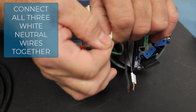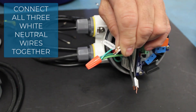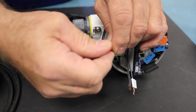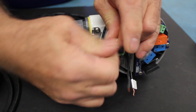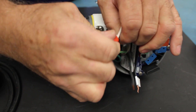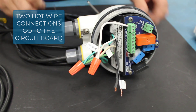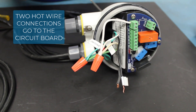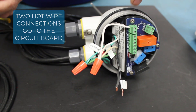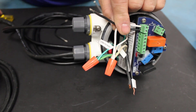We'll take that white jumper wire and connect it to the white neutral wire coming in on the power cord, and we're going to connect the white neutral wire that goes to the light as well — these will be unswitched, direct neutral to the light. We'll put a wire nut on to secure those and pull on each wire to make sure they're tight. Then for the hot connection, we'll put the wire in the L terminal to power the BMRX and tighten it down.